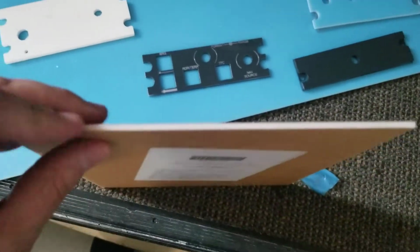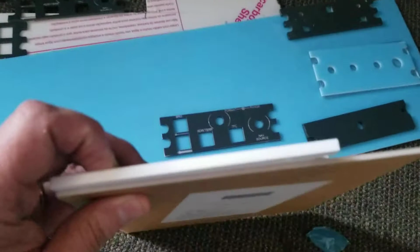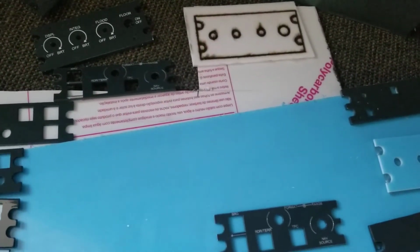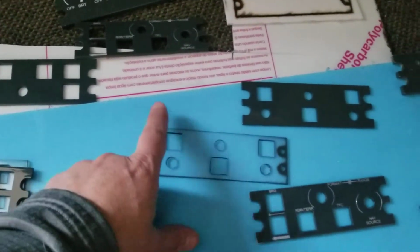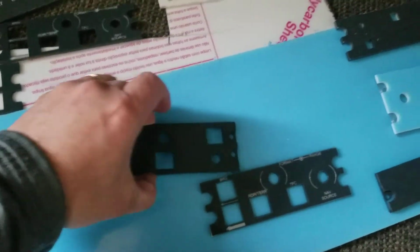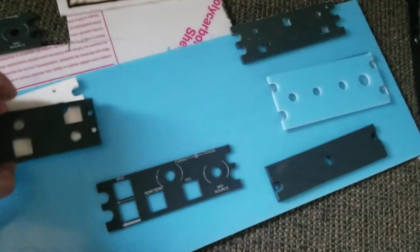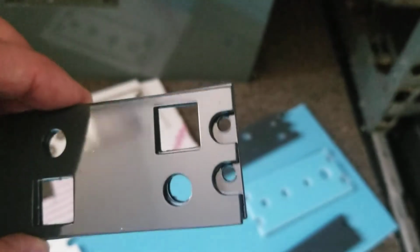Now when you get these, you're going to notice the depth, how deep these are, and depending on your laser cutter, how that's going to affect it. And you compare that to my original ones, it's a big difference. But these are designed to go in with the traditional hardware for the aircraft, and I'm retrofitting these into a sim, which is a different type of build. So the way I accommodate that, I'll show you an example here, is I print two pieces. One of them is completely squared out, and the other one has the grooves. And then this goes right over top of that one. The height is perfect to match up with the originals as you set them side by side. It's literally almost a perfect match. And then I've now got spots to mount my hardware, my screws and bolts and so forth, that can just mount right in there.